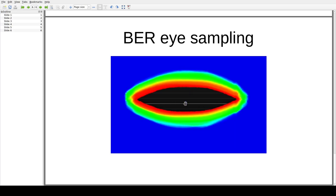Sampling near the edge of the eye, you start seeing occasional bit errors and can determine you're near the edge of the opening. The same applies vertically — by deliberately offsetting the sampling point in the vertical axis, you can determine when you start seeing bit errors as you move further from the vertical center, giving you the vertical margin. Scanning the sampling point across the entire eye horizontally and vertically and accumulating BER at each point gives us a density map of BER at every possible point within the UI — that gives us our eye pattern.